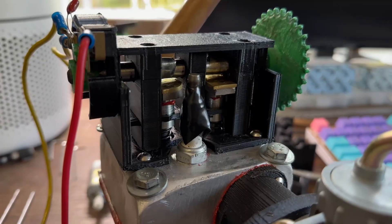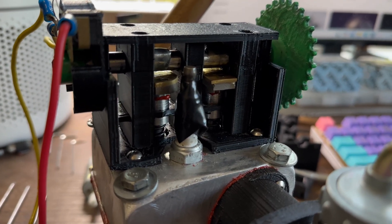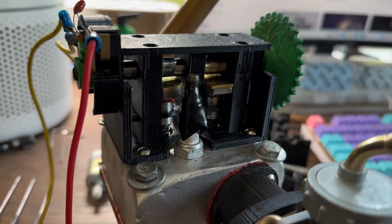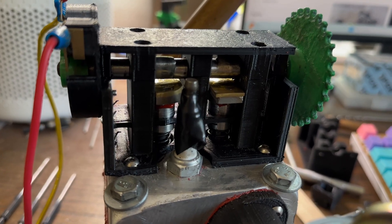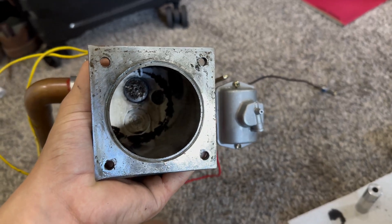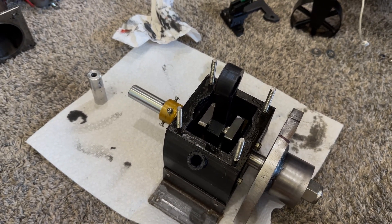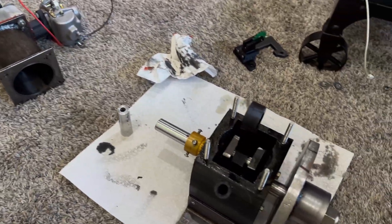It completely melted the piston again. PCBWay, thank you very much for supplying those metal valve rollers — I never could have machined a hex with the tooling I have, so that was a huge help. It definitely worked: if you look at the previous exhaust roller, it is warped and bent. It ran 20 seconds longer, with a total runtime of 1 minute and 11 seconds — a new record, officially over the minute mark. In the next video, I'm probably going to make either a cast iron or aluminum piston — thinking cast iron so it doesn't gall the steel cylinder. Thanks for watching, make sure to subscribe and leave a like!